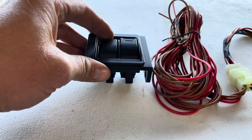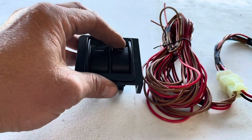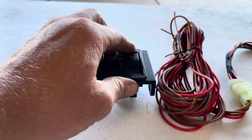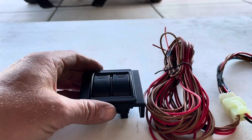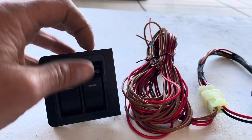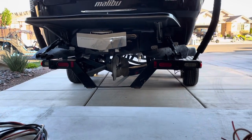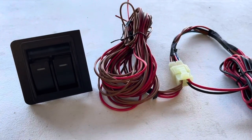If you're surfing and want to surf on the regular side, simply push the button on the regular side. For the goofy side, push the button on the goofy side. If you want to do a transfer, push one down and pull one up. To retract both tabs, simply pull both up. These work fully as trim tabs too — just put your fingers down, very intuitive. With most boats, we've dialed these in so you simply deploy the tabs all the way without needing to mess with the angles much.